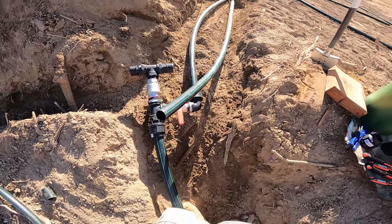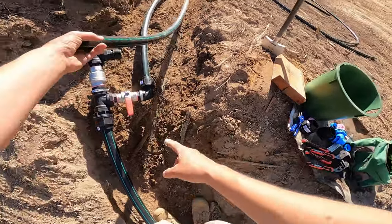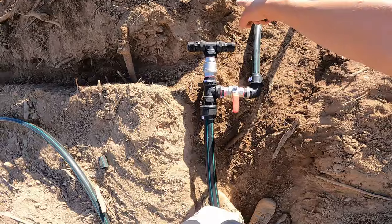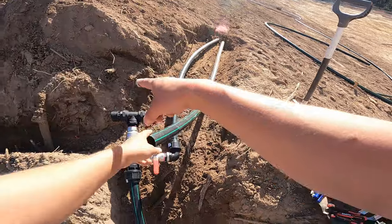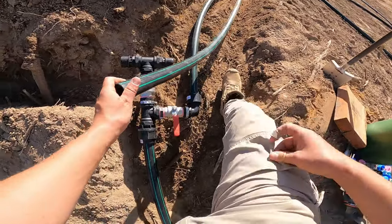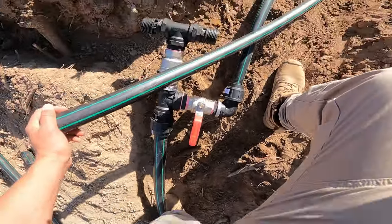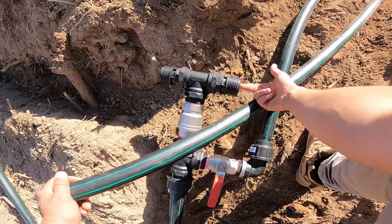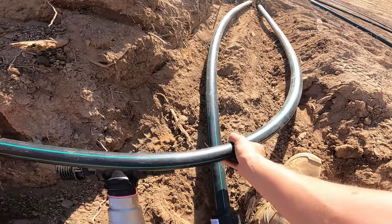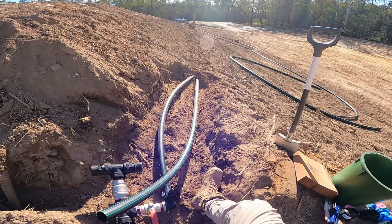It's taken almost two hours to get this far, but slowly we're getting there. This pipe has changed direction because I realized getting it all the way to the original position would have been too hard — I would have had to dig the whole area out. Poly pipe is not easy to curve; two inch you pretty much can't curve it past its natural curvature. The one and a half inch needs to go a certain way but is on an angle, requiring a wide bend in that direction. We've had to widen all our trenches to take into account the curvature the poly pipe requires.